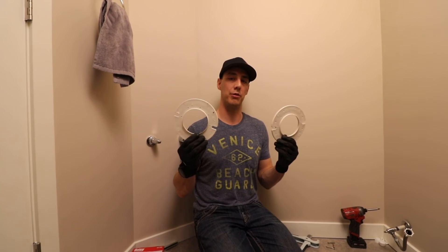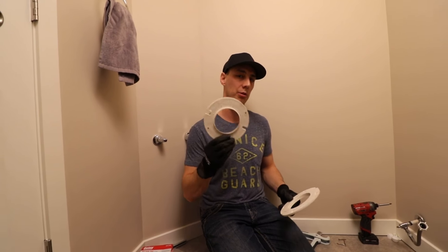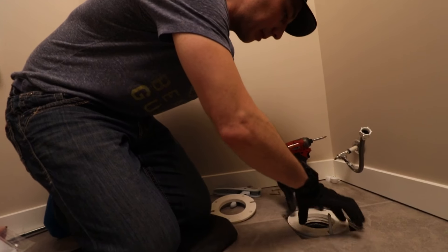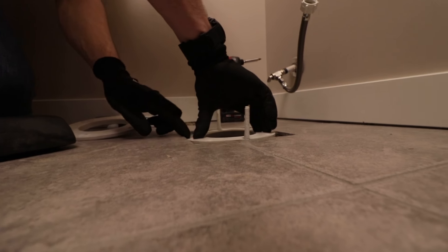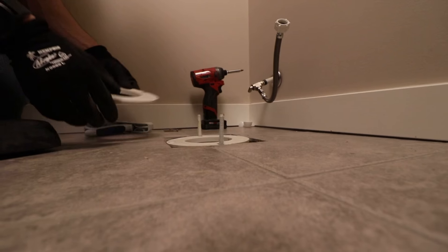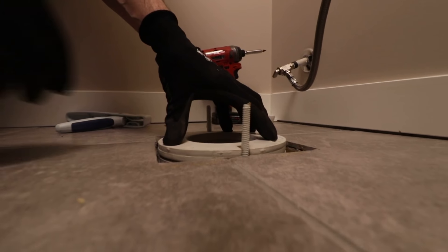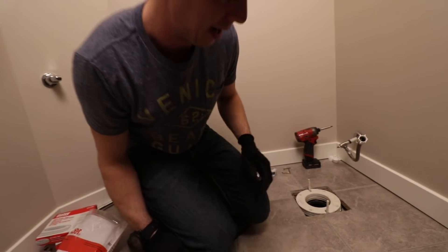We're going to take two of them — I'm thinking we'll probably only use one, but we'll check what two does. With one, if you push it down nice and tight pretending it's been screwed, it's fairly flush here, a little bit high over here, fairly flush all the way around. If you were to add another one you're just going to be sitting a little bit higher. For me personally, I'm just going to use the one because I like to have my flanges flush with the floor so I can use the horned wax seal — that's our preference.